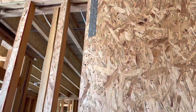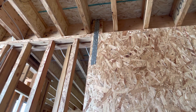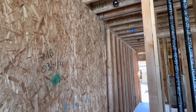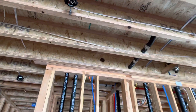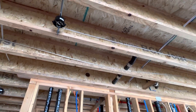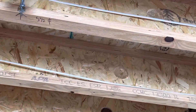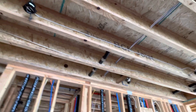This is pretty much it on framing. These straps are structural straps to tie everything down — whatever the engineer calls out for. He's the most responsible; he's got his wet stamp on the plans for anything structural. He's going to be the one when the slip-and-fall attorneys come after him — the engineers have all the weight on their backs. Those holes are getting pretty scary-looking — it's like they were bored in the wrong spot. They're there, but that's not big enough to compromise the integrity of the laminated I-beams.